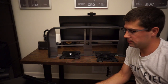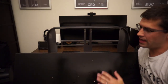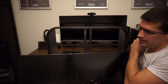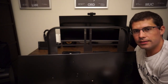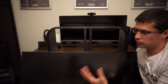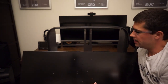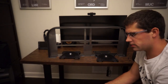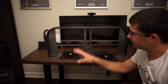It's really quite simple and it works quite well. After we've done the drilling and the milling process, it does roughen the panel up — it's not going to be that nice satin black anymore. So what we do is strip it down and re-powder coat it a nice satin black, which gives it that final durable finish and makes the product look really complete and clean.